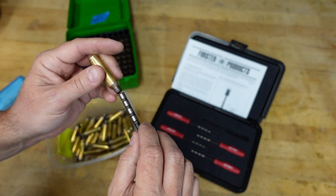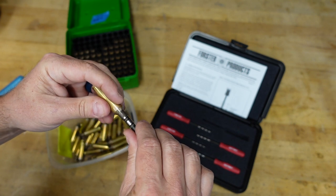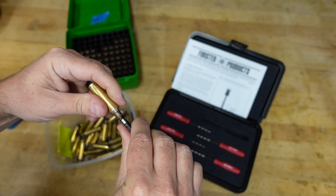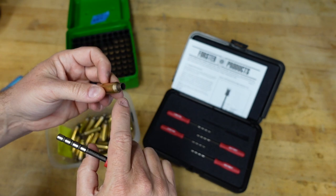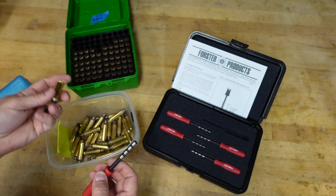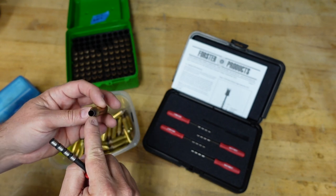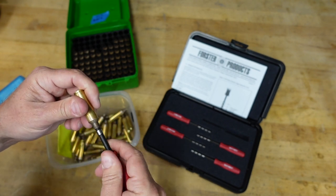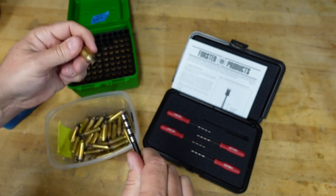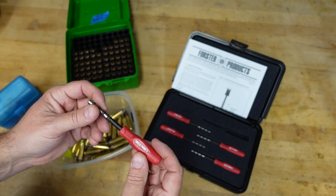The 280 diameter goes through the donut, but the 281 diameter is hitting it, so I'd have to kind of force it through. Then the 282 is too big for the donut — if I jammed that in it might go over — and the 283 would be the same. Measuring something with a donut can be a challenge with this tool because of that. With individual gauge pins I could put each one in separately and get a good read, but I can't get past the 282 here without really shoving it through.